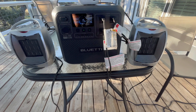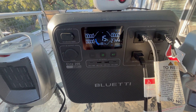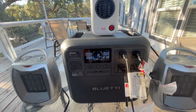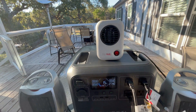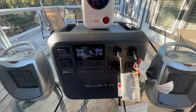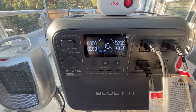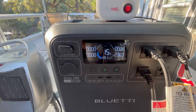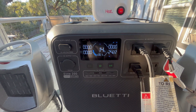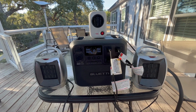It's been running for a couple minutes with just those two space heaters on full blast — between 2,100 and 2,300 watts, no problems. I'm going to add a small space heater now, about 250 watts, to get it really close to the max. We're over 2,400 watts now, right close to the max — and it passes that test.